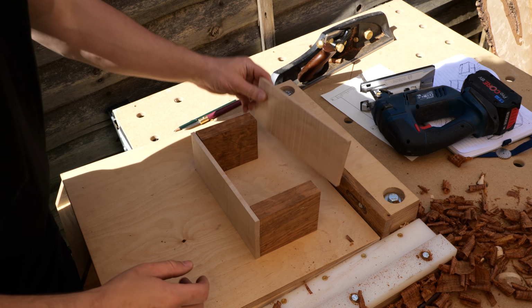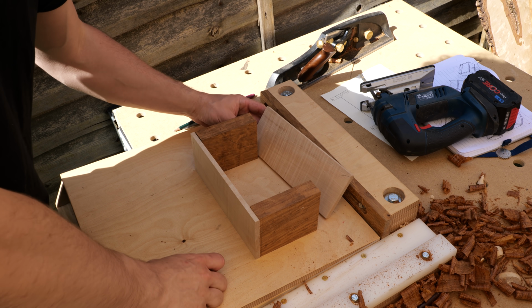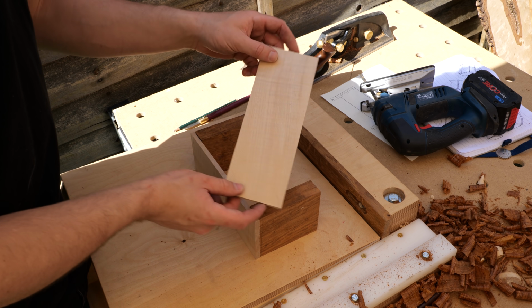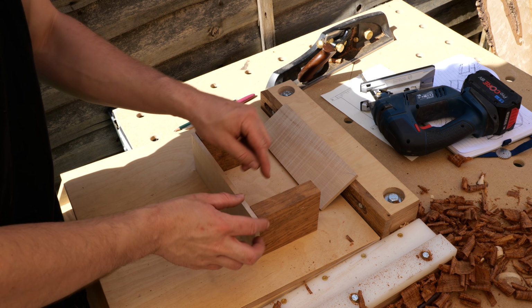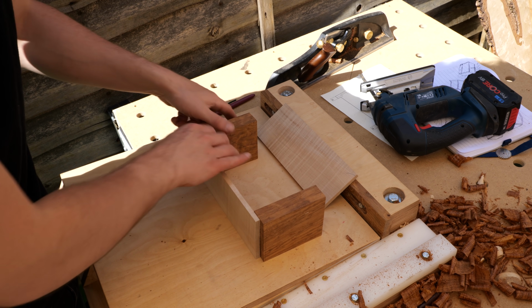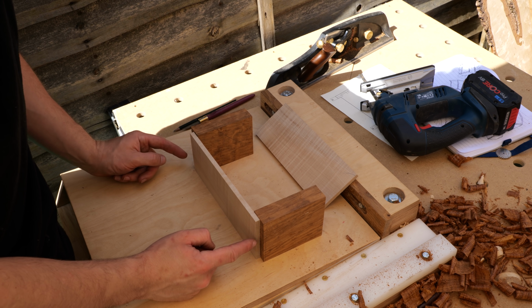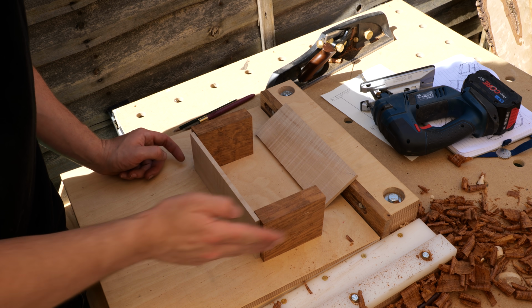That is silly. It's not major, but it's a little bit annoying because the box is going to end up a little bit smaller than I'd hoped. What I did was I cut the front and back to their final dimensions, forgetting to take into account that these edges are going to be bowing out beyond the edge of the box. What I wanted to do was cut the front and back to the overall length of the box and then shape the end of the dovetail as well as the side all in one.